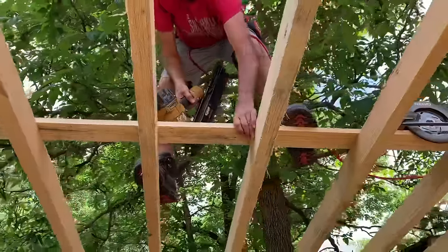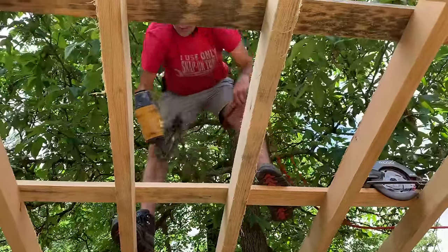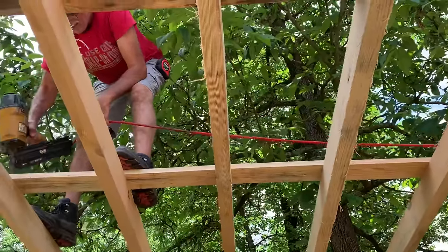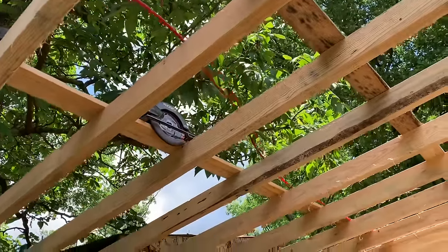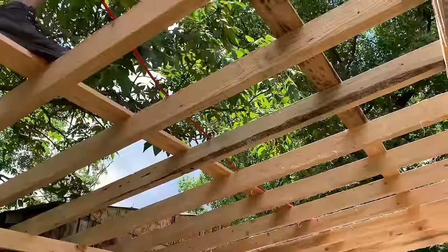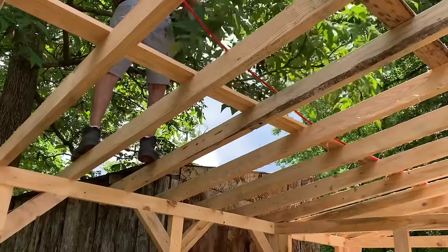Give me that tape measure. Okay, we got all the rafters up. Now he's putting up 1x4s. This is so the metal will set on it. If you don't know that. Here again, we've only used 2x4s for this because it's a chicken house. If you live in an area where there's a lot of snow or a heavy snow load, you may want to do a steeper pitch and maybe heavier, like 2x6s instead of 2x4s. But we don't get snow here, so very little.